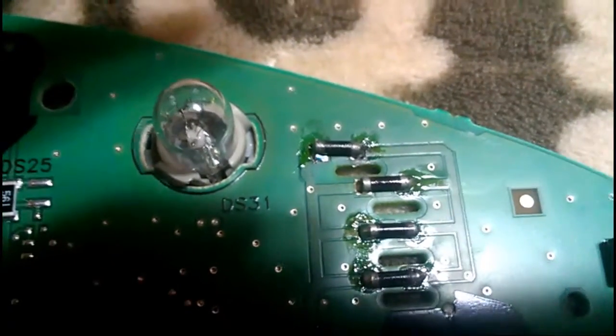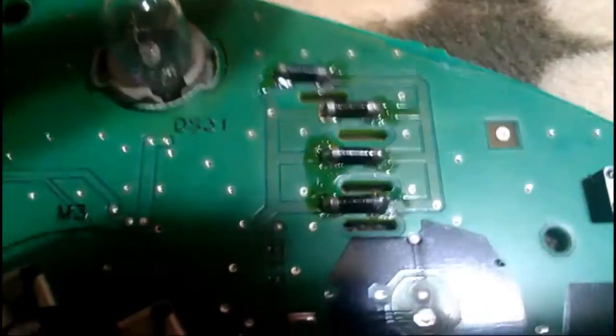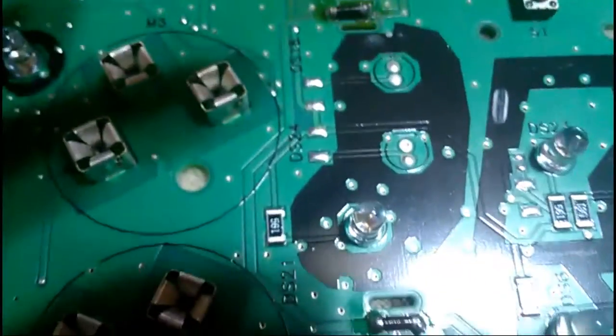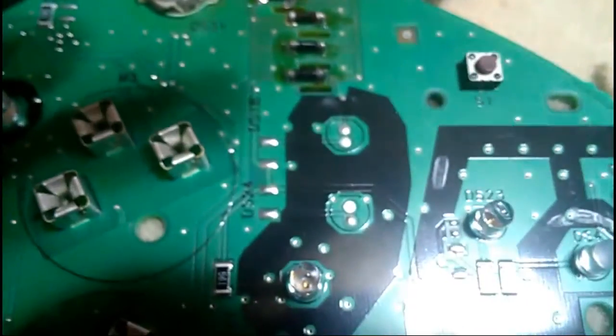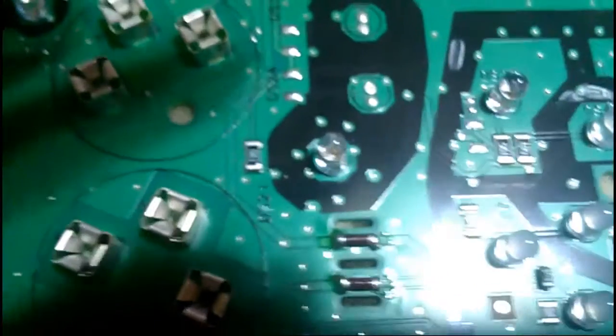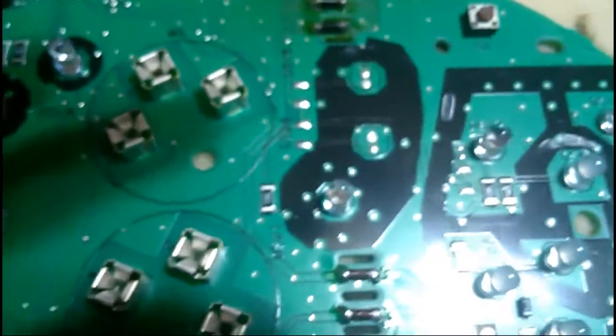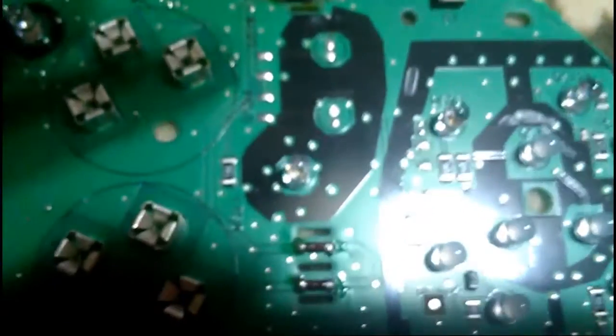It was pretty tough to get it back on there semi-straight — you can see it's pretty crooked. But I got enough solder flowed on to each end of it that it did work. The other three didn't look too good either, so I went ahead and reflowed those. And just down the track on the other side, there are two other ones that also didn't look very good. So I went ahead and reflowed the solder on all six of those. The other five were still in place, so I just reflowed one end at a time. I had to do quite a bit of scraping with a mini screwdriver on each end to get some bare metal showing and get the carbon deposits out of the way so that the solder would stick. You may have to do some cleanup before you solder. Once you've done that, reflow the solder on each end of those, get them nice and solid, and when you reassemble it you should have a working display.